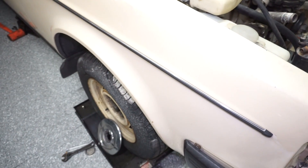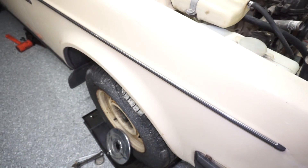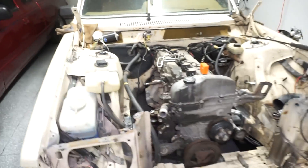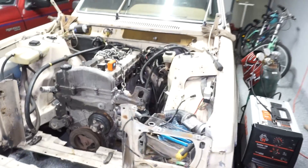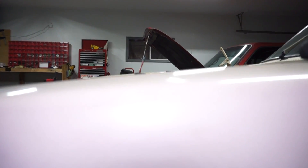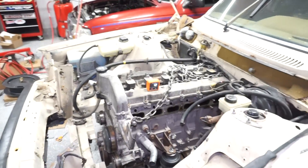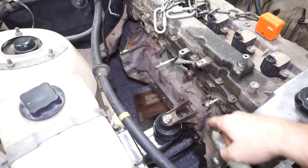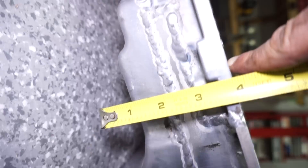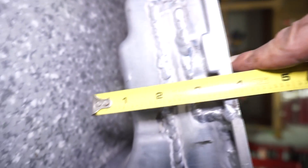Hanging over the side working on stuff — it's so squeaky, makes so much noise. But I think I'm going to end it here, consider it mounted, everything looks pretty good. The engine isn't even over the top of the fenders. I measured the oil pan line to the K-member and got about three and three-quarter inches, so if I mark three and three-quarters on the oil pan I should be able to clear that section — it'll be really close.